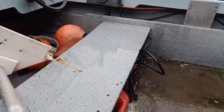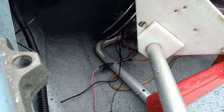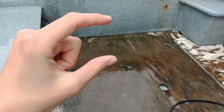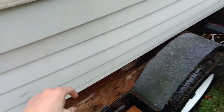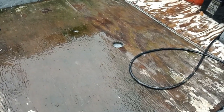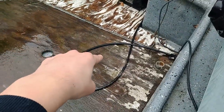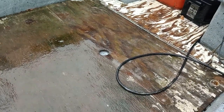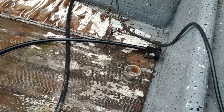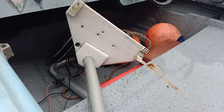There are a couple other mainstream things. One is this awful-looking floor. Now you might wonder why this floor doesn't look so bad — that's because this is the actual inner floor. This boat is like a sandwich: it's got the hull down here, and up here is this thin floor, with air and a honeycomb structure in between. The previous owner actually broke a hole right there and in the back of the inner floor, and as a temporary fix just put some old pieces of plywood in. There's also a mount for one of his downriggers, along with a bunch of that equipment — we're going to try to sell that at a swap meet.